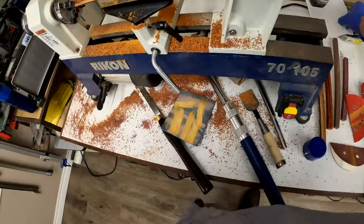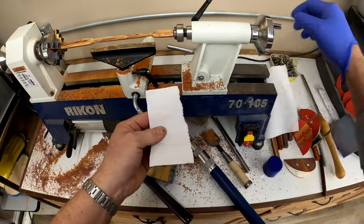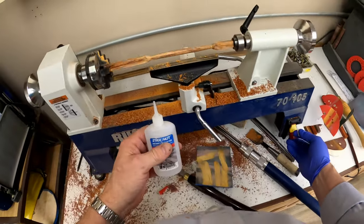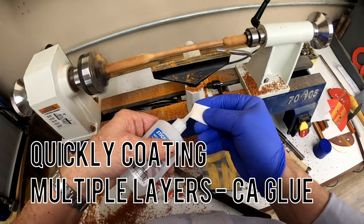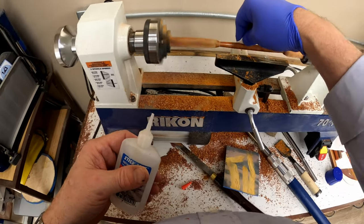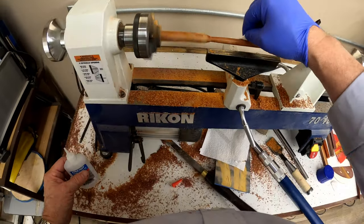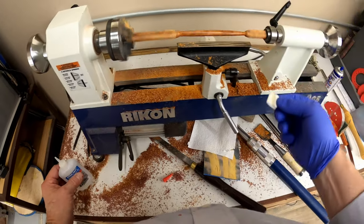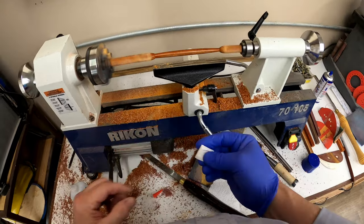To finish, you'll have a number of choices to add some gloss to your pen, but I've had really good luck using CA glue, which you may recognize by another brand name: super glue. You have to work quickly as this stuff hardens in an instant, but I get a really great gloss shine by wiping on multiple layers of thin CA glue. It provides a really hard finish, it's very glossy, and it holds up really well over time. I'll fold up small pieces of paper towel, wet the end, and immediately wipe down the length of the blank. The lathe distributes the coating pretty evenly.